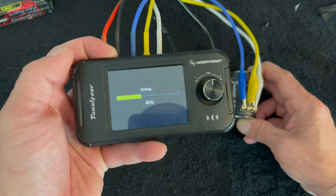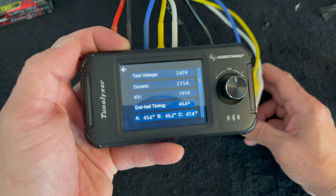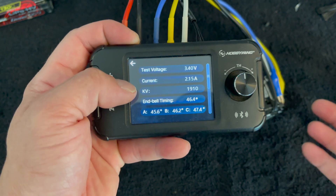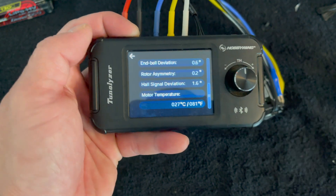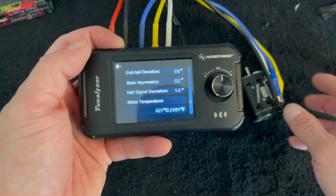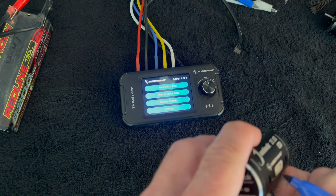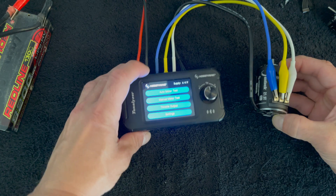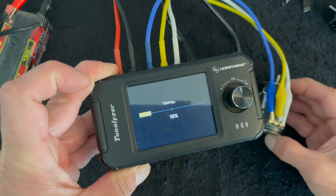For the sake of science, we run each motor twice, log the data, and then look at the spreadsheet. Running the second test — there's a small bit of variance as you'd expect with alligator clips and slight temperature changes, but nothing major. I marked this one motor number one with one dot; motor number two gets two dots. With the motor wires connected correctly, hit the auto test and away it goes.